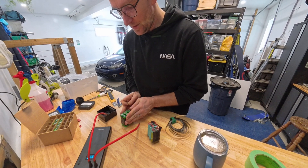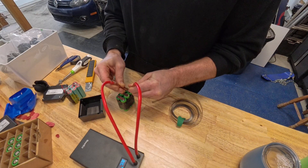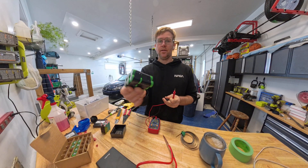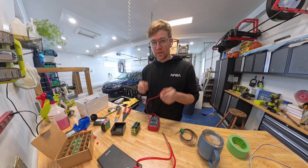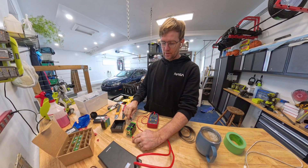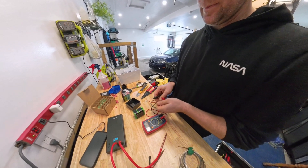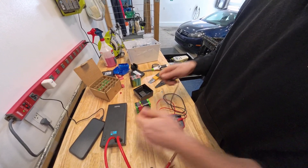You want to make sure that it's all lined up good. I got the one battery pack built. I'm going to do a second one because I need two. You want to verify that the voltage is correct — positive on one end, negative on the other end — and I've got 12.5 volts, which is the correct voltage. You want the 12-volt battery pack, and right here it's reading 12.5 volts, which is perfect.